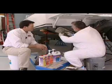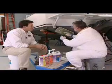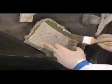Okay, now what is going on with epoxies? You usually have something called an amine blush. What is amine blush? Amine blush is from the hardeners, and it's reacting with moisture in the air and leaving a film on the surface. It can look like suntan lotion on the surface when it cures up. Okay, and what's the downside to amine blush? Well, it can act as almost a release agent. It's a contaminant. You have to remove it. How do you remove it? Well, the way to remove it is by using a Scotch-Brite pad and just some warm water, actually. You don't really need to use a solvent.